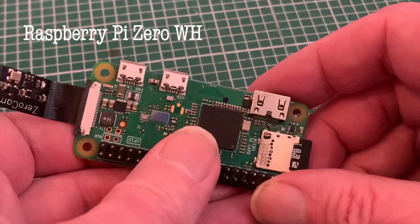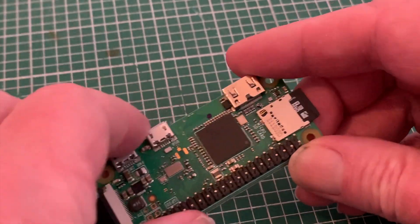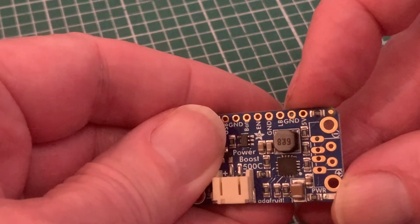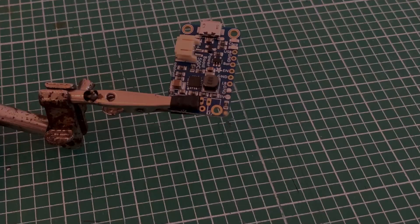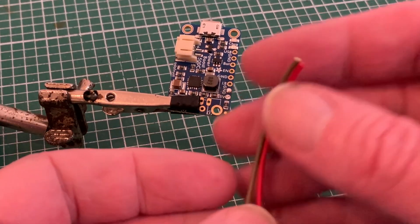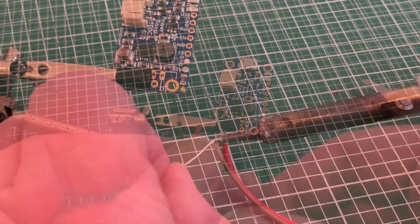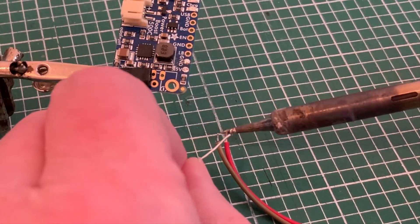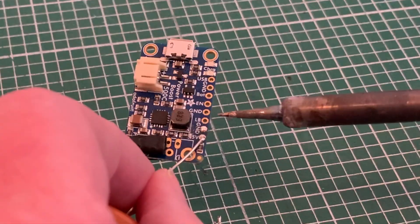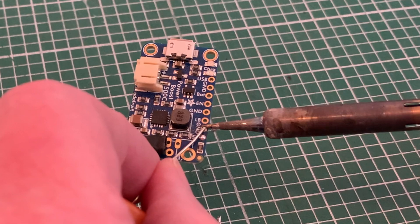As well as the standard USB input, we can also power our Raspberry Pi direct from the GPIO pins. Our Power Boost has two terminals just for that, and instead of that cumbersome USB socket, it's to those I'm going to solder two short jumper cables from which I've snipped off the plugs, leaving the sockets at the other end. First I'm going to tin the bare ends with a little bit of solder, then putting a similar blob onto each of the terminals will make attaching the wires super easy.